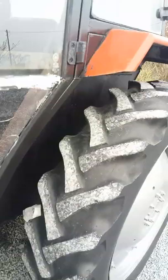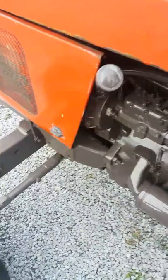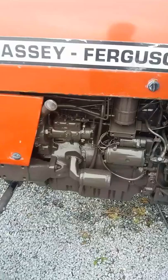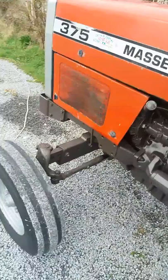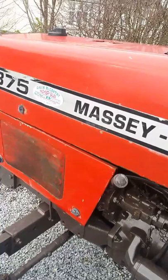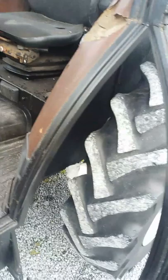Let's have a quick look inside. Before that, one thing that helped me with the diesel pump — the injector pump — is the stop valve, which got stuck. I came out one morning and couldn't start the tractor. A friend recommended putting fully synthetic two-stroke oil in with the diesel. He said it runs through the system, keeps it clean, and stops the whole thing clogging up, especially if the tractor is not in everyday use. Mix semi or fully synthetic two-stroke oil through a drum of diesel and put it in — it works like magic. Or if that doesn't work, just tap the pump gently and that'll free the valve inside.